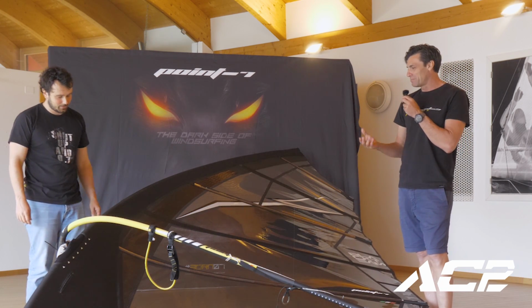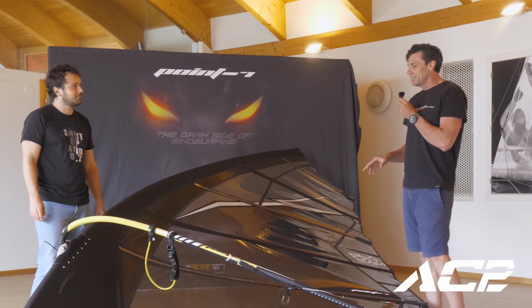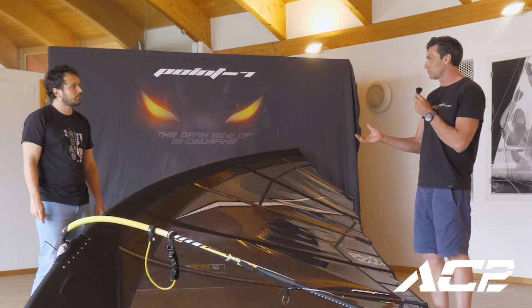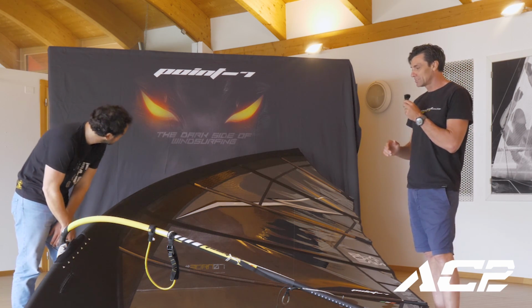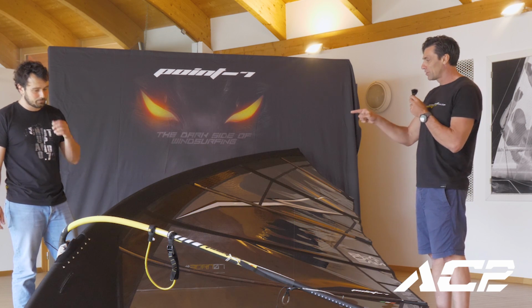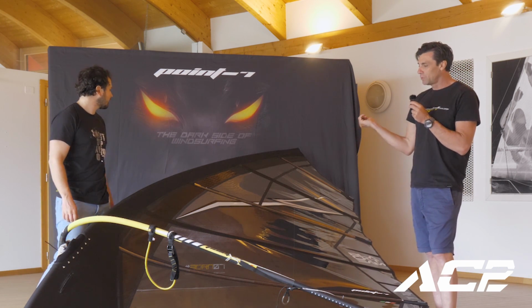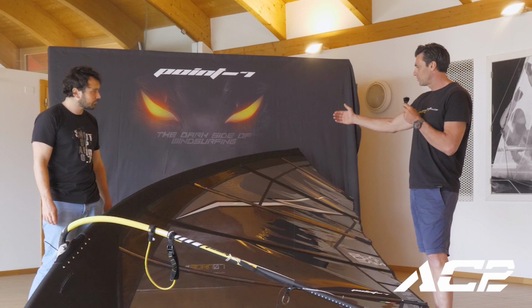So it would be the third cam. It's not there, but it looks like there's a cam. There are different things that we did. There's actually a luff panel which starts from the bottom of the sail and goes all the way to the top. It's one whole piece, and this brings in the profile to keep this nice shape. So that helps a lot for sure. It's one of the points. We have Kevlar reinforcements underneath the stitching, yes, there exactly, which are pulling in the profile again. So that's why you have this nice corner also on the top of the sail.